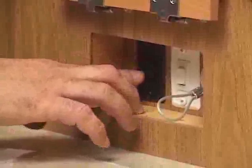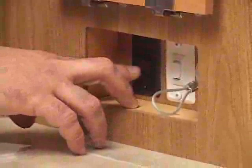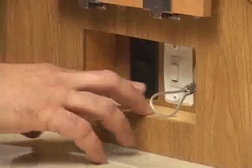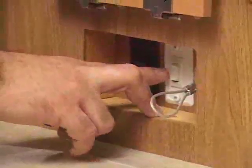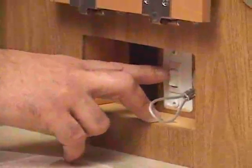To raise your high-low, you'll select the master switch into the raise and lower position, which in this case is the down position. That will energize your lift system switch. To raise the trailer, you simply push the up button on the lift system switch.